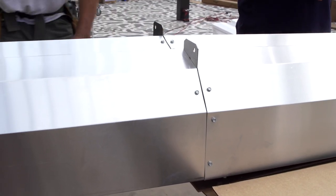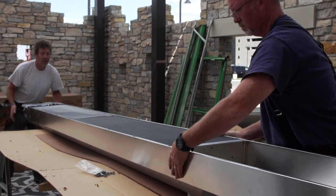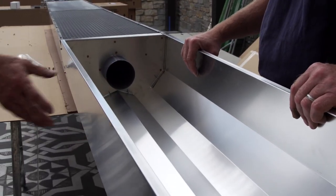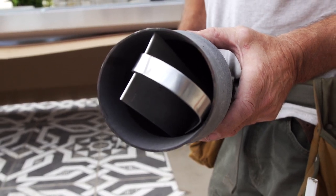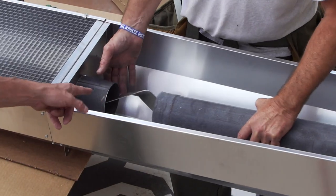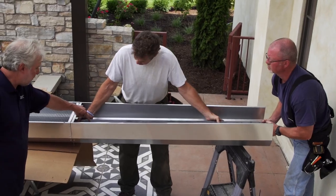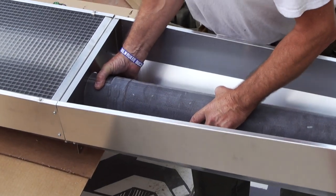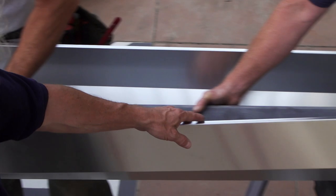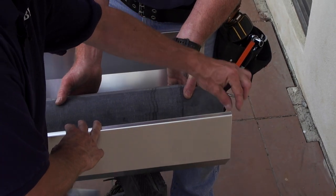Now we've got enough screws in the piece of reflector to hold it in place, but we're not going to put the two remaining screws on the side — we'll show you why. The next step is to turn the entire unit over; you'll need two men. Now the unit is shaping up. The next step is to take the piece of pipe that we already had inserted our baffle into. Now that we've got our reflector installed, we're going to insert the baffle and secondary piece of pipe and connect it to the main unit section. We've got a flare connection here, so this auxiliary piece will slide right over the main pipe coming from the unit. Sometimes you have to work it in by twisting. We want to slide it to a point that the other end of the pipe is roughly half an inch beyond the edge of the reflector.